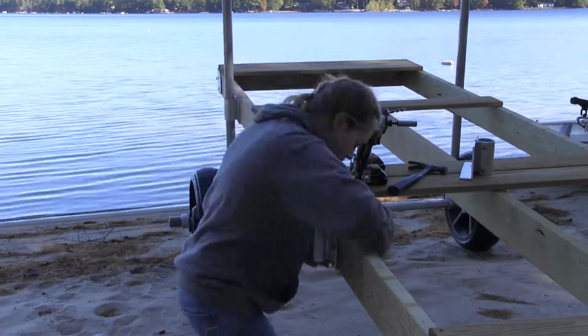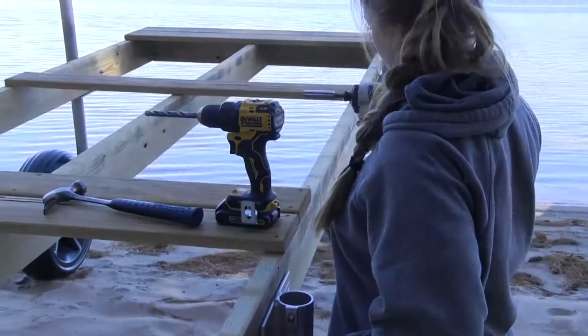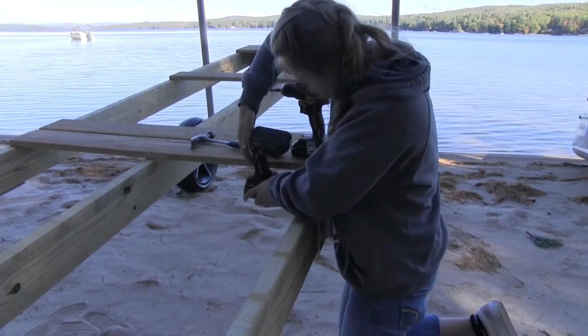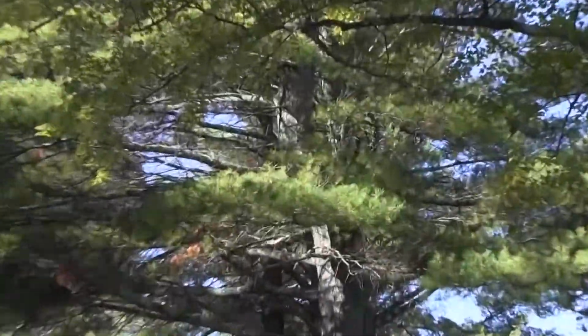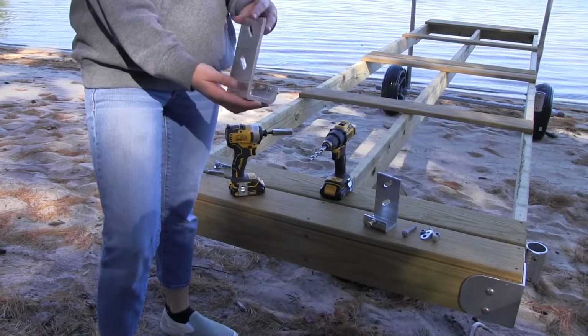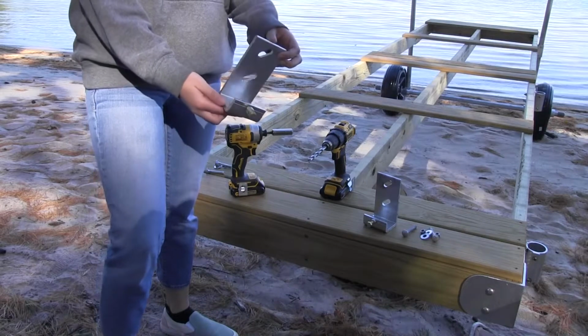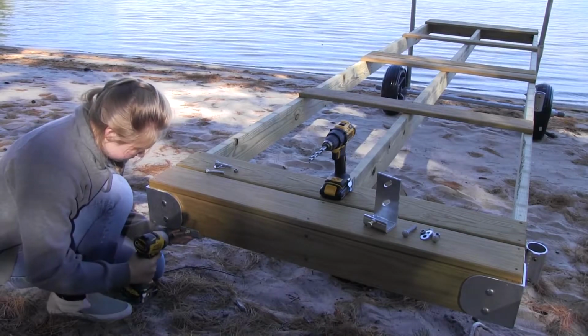The two dock legs and two wheels is fine for transportation, but here we're adding leg supports so we're not spanning more than 10 feet. We'll be using the J-brackets to add another section that we're going to use as a ramp to shore. The brass bolt is used to clamp down the corresponding section.